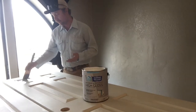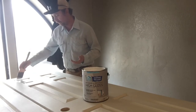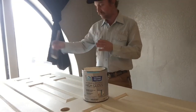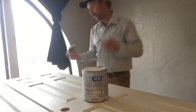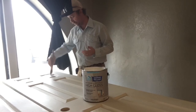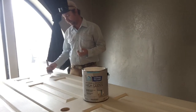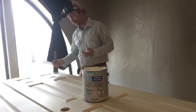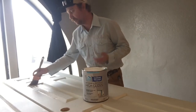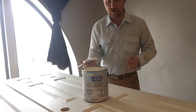The way I do it first of all with these six panel doors — they're just a hollow core six panel door from Lowe's — I go in and first thing I do is paint the panels. Every single time I do this, every side, end, everything, be sure that you back-brush it all. Like right here, come around the panel, I do the edges first and go right straight around. Make sure I get a coat on all of it. Back through the middle now that it's coated — this side needs to go this way, this side goes this way, the center gets hit, the end gets touched up, and make sure these rails are still going straight. It doesn't take any longer to do it right than it does to just paint it all going one direction with your brush, and then from then on you'll always see those brush marks.